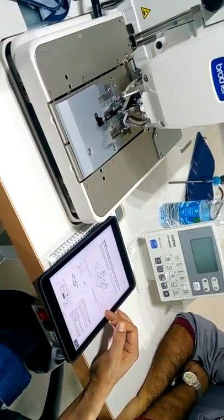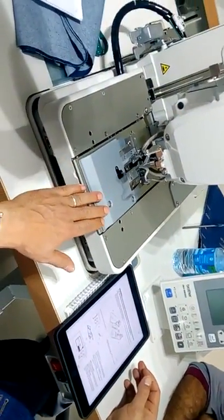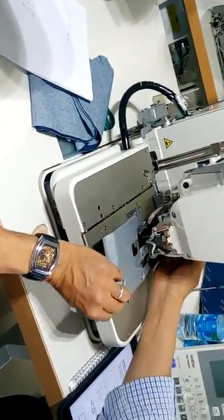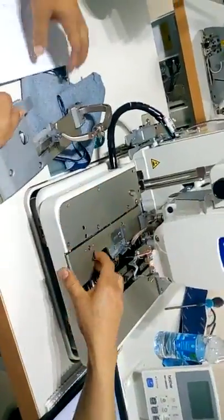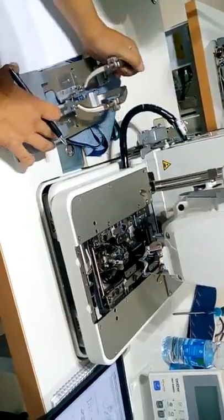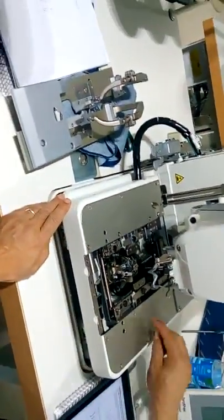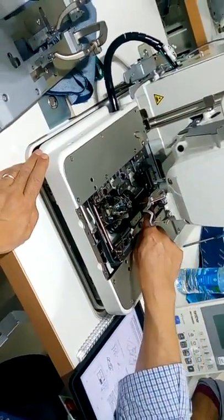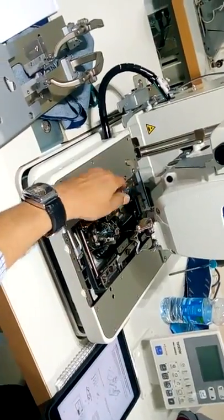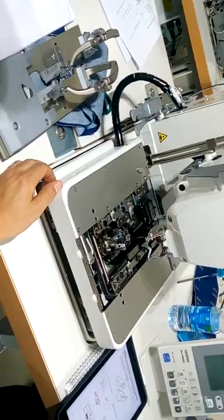Okay. 734. It's here. How to adjust home position. So up to you, maybe take out these clamps. When you go in this mode, then for X direction, you have to take a measurement from this to the center knife, and from this to this center knife should be equal. Yeah. Should be equal. This is X.